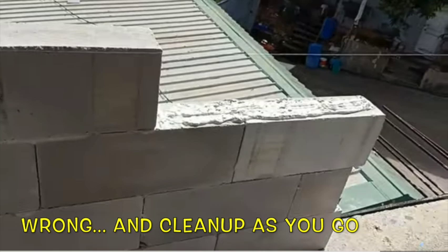But all that being said, the root is in the history. The history is this is how we apply to blocks, and they don't care about the material. It's very difficult to get through to these guys. No, more is not better. This is an adhesive. Even at the tile store, they were saying apply this much. That's not what you do. You don't want air pockets accidentally showing up in your work. And if you have an air pocket, you have no strength at all.